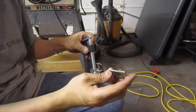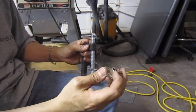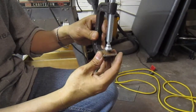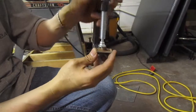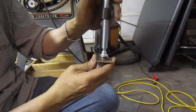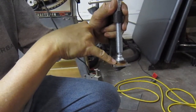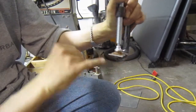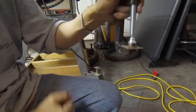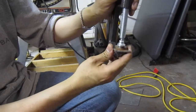Okay, so we're talking about making these out of a piece of probably 14 gauge steel and a nut. I was just saying that we could put the piece into a C clamp and tighten it down so the nut would tighten down where this extension is right here. Then you take the MIG welder and tack it on this side and on this side, and once you've got those nice and solid with a little extra heat, tack here and here, and that would make the captured nut. That should be pretty easy to do.